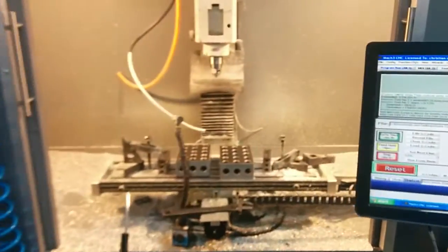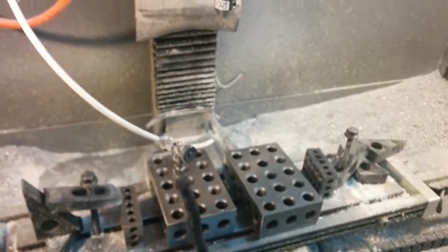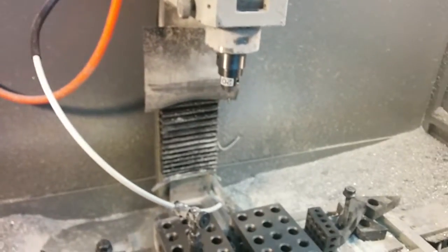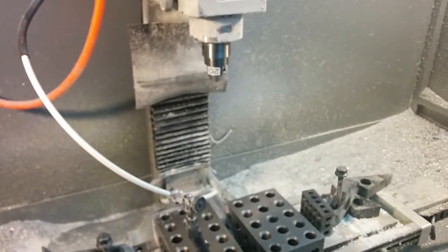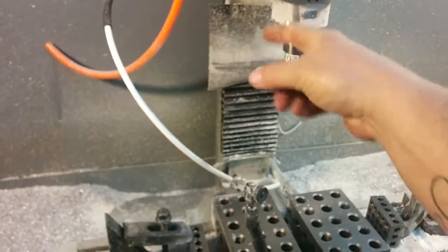Of course, now the milling machine is a disaster area. All the chips and all that G10, that fiberglass is some nasty stuff. I'm going to have to really clean the machine down good once it gets done. Once I've got one more piece to do, and then it'll be it. I'll clean everything up because all the ways and screws and all that have that dust in it. That stuff's nasty, and it'll chew up your metal pieces.